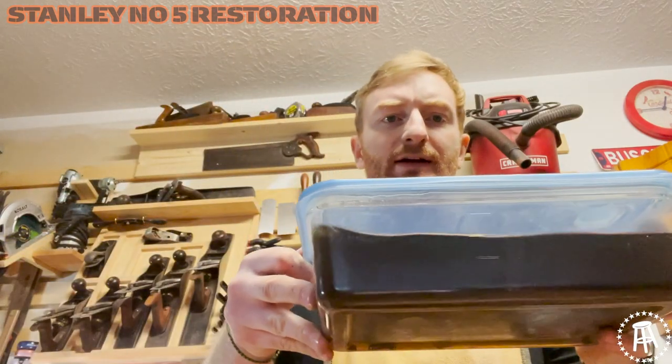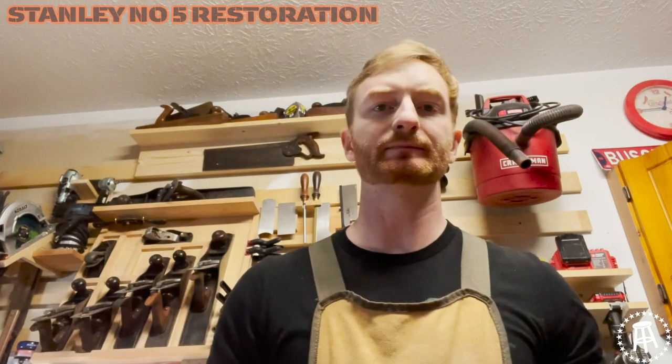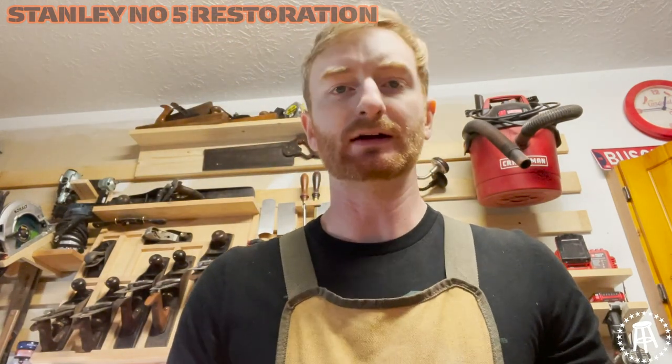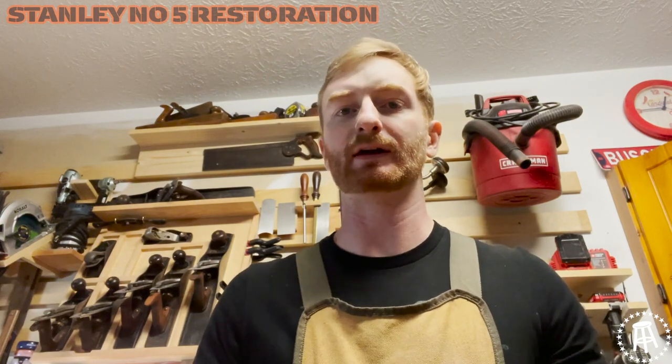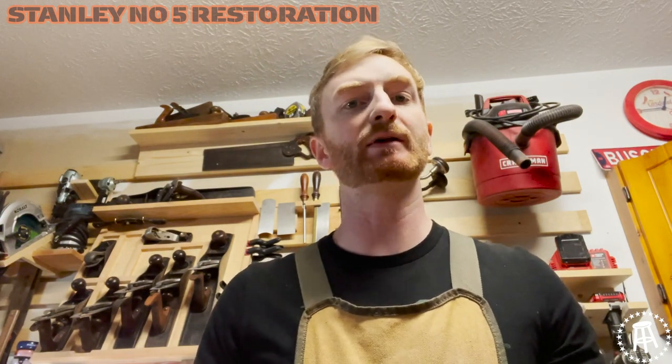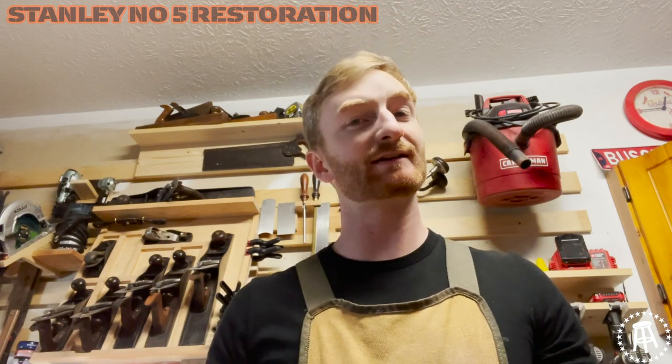I got everything soaking away here, getting all the rust off. What I'll do is the next time that you'll see me in this video, I will have it all out of the rust bath. And what I do, I rinse it underwater, get all the solution off, and then I put it in the oven at about 200 degrees for a few minutes just to get the water out of there.